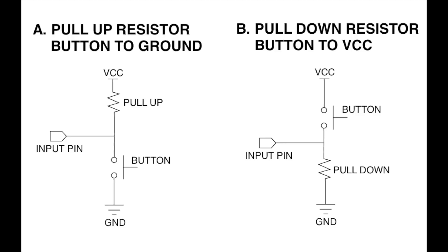When the button is closed, it attaches that input to ground, which overcomes the resistor — because it's a fairly large resistor, it's easy to overcome with a short circuit — so the processor sees a logic low. When you do a digitalRead in an Arduino program, you will see a zero or false when the button is depressed, or a one when it's left up because the pull-up resistor pulls it high. The opposite is true in image B: a resistor always pulls the output down when the button is open, so you read a zero, and when you close the button it pulls it up to a logic one.